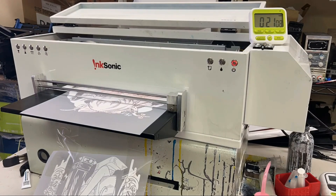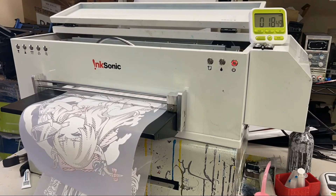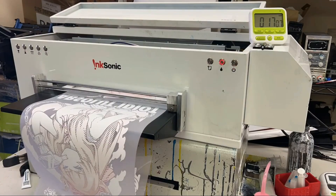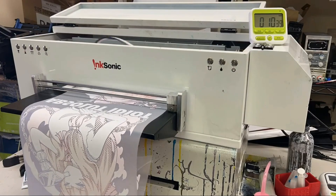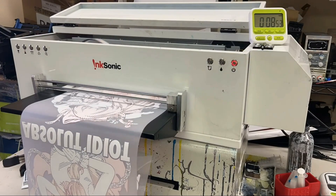Every half hour of printing, use the print head maintenance button and do a cleaning. Get a second timer for the ink reset. When you see a hard clog — lines in your prints — remove it using strong cleaning. Watch my next video for the maintenance shutdown of this printer. I hope you enjoyed this video. Visit bchtechnology.com or locally at Greensboro, North Carolina. Cheers.